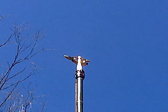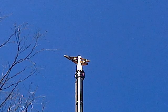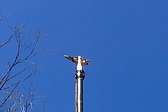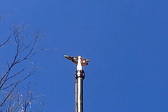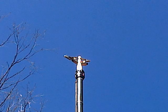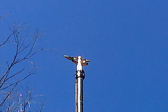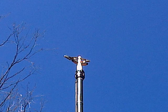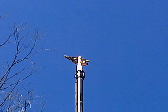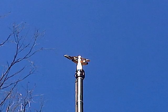It's exactly 20% bigger. It's heavier, but it's supposed to do a 33 meter diameter circle, and running on the dam pump, it should do 50 litres a minute. So it'll go further and put out the same amount of water. And it's up higher, so the water should descend vertically from out of the sky